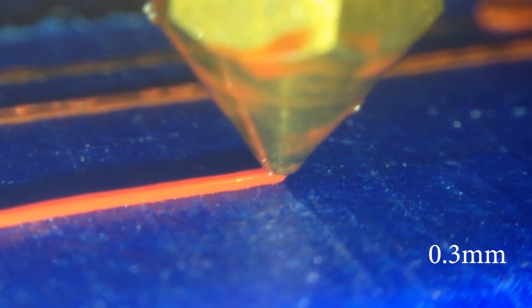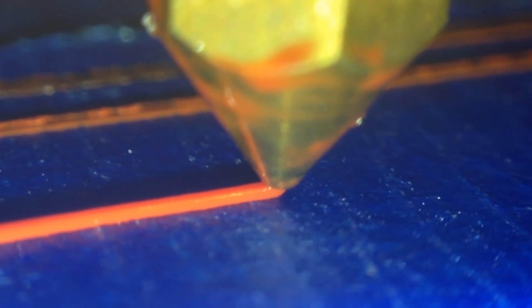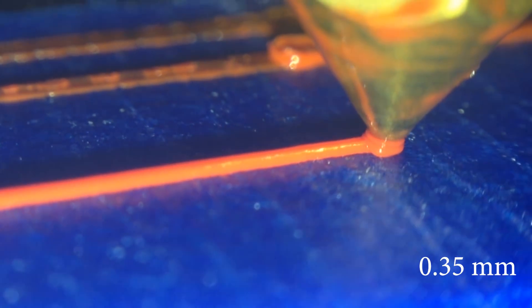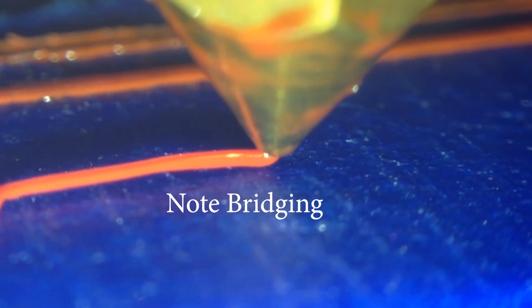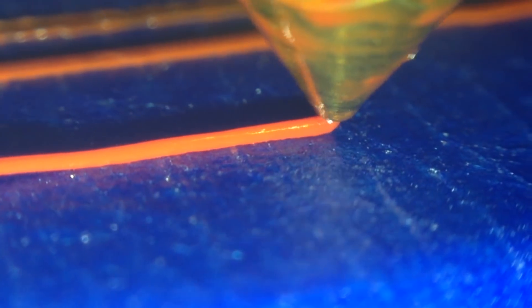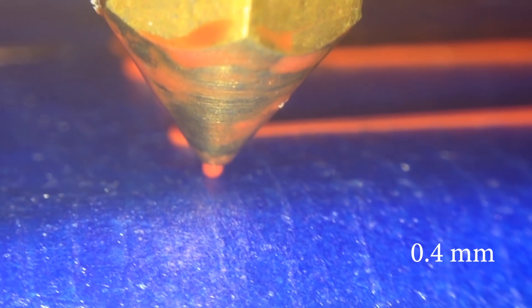Often people will go with this layer. It's actually too thick, and it's almost completely circular, so this will have a real hard time actually sticking. Obviously at this point you can see the beginnings of bridging, and we're not even actually touching the bed — it's really relying on gravity to stick it down. This is actually a neat indication of it trying to ooze out and prime the nozzle, and not even touching the bed. You see it dragging along there.